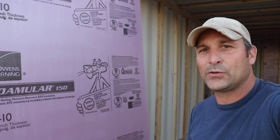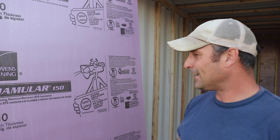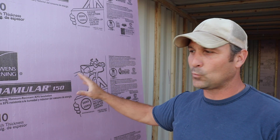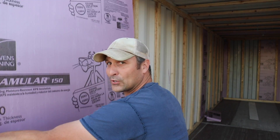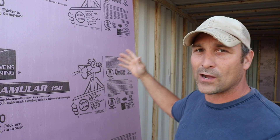For the insulation I'm going to be using the Owens Corning Pink Panther brand — pretty much everybody knows it, kind of famous — but it's the rigid foam. I'm using this for a couple of different reasons: one, because it's pretty much cut it and stuff it into place, it doesn't sag, it doesn't do anything, it's really easy to work with, and it is super light. I'm going to be putting this in the walls and show you how, and then once that's finished we'll add the cladding.